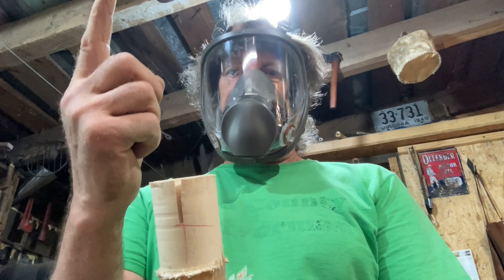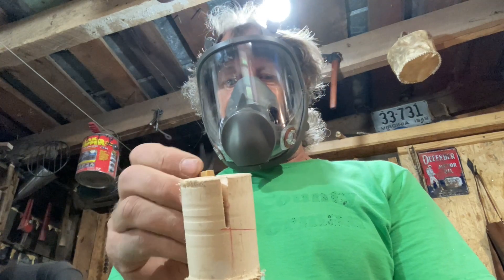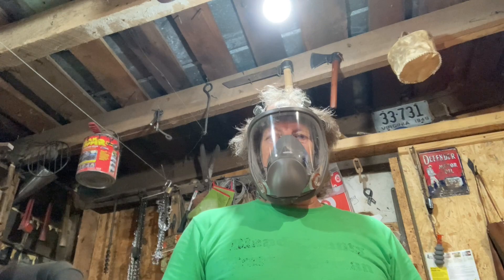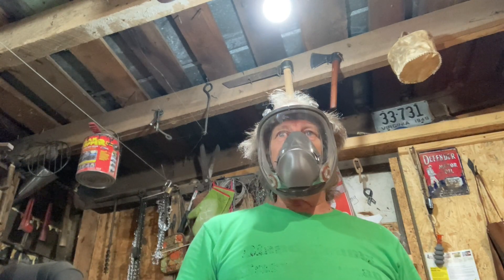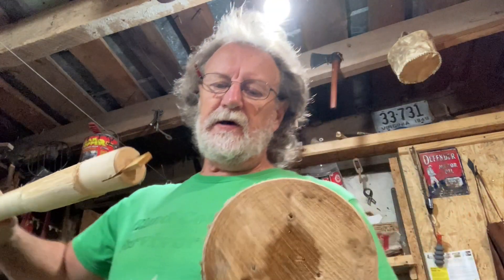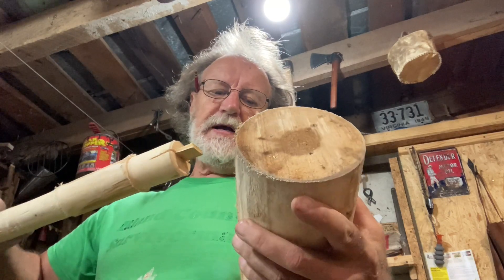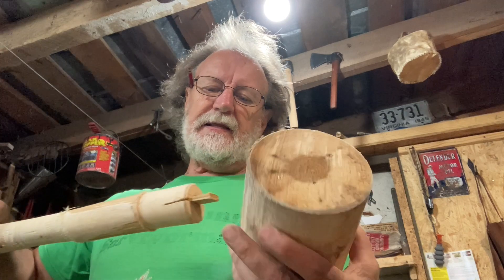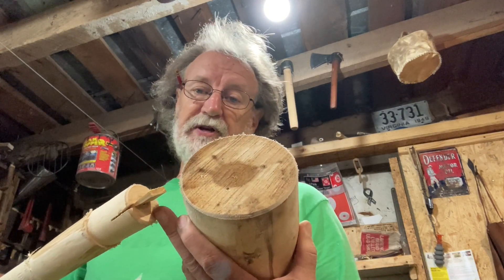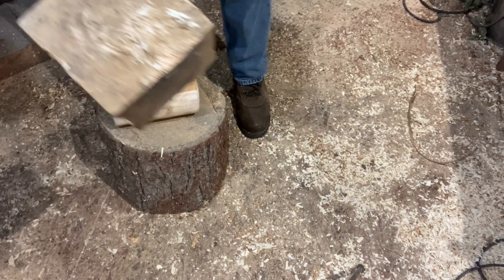You see through wedges where it goes all the way through your handle — this one's called a disappearing wedge. It needs to be cut off just a little bit so it doesn't come down and crack the handle. I'd like to thank my wife Miss Libby for giving me this safety gear — breathing dust is a whole lot weirder. You want that wedge sticking up right there in your slot; as it goes in and bottoms out it will spread out and the wedge can't slip back. Let's hammer that thing in there and see how she works.